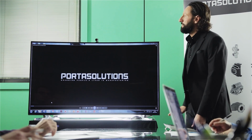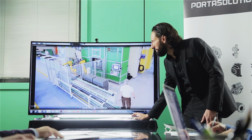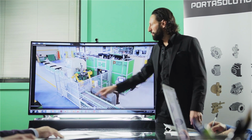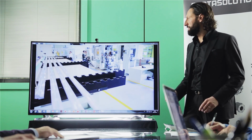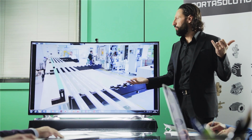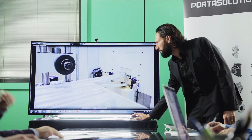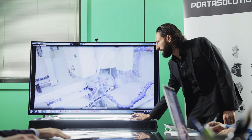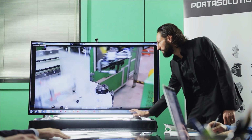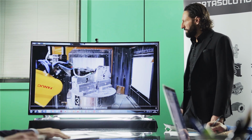This is a similar application with aluminum automotive parts. In this case, there is an 8-meter long bar and unloading onto containers that the customer gave us from his washing machine. So he doesn't want to know anything about it. He has the 8-meter bar and his washing machine container. So we take care of all the handling and machining between these 2 points. So there's the cutting, then taking the part from the buffer into the load and unload station, 2 parts at a time.